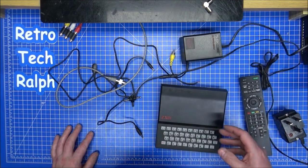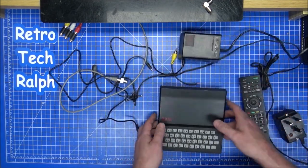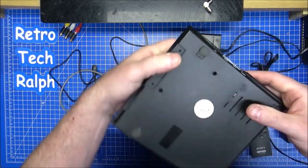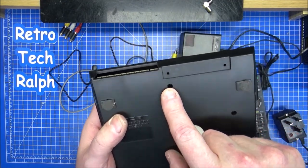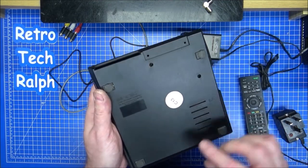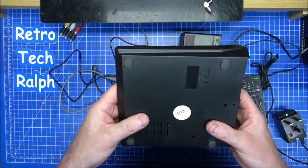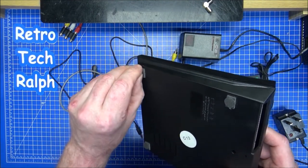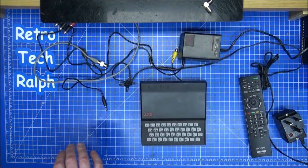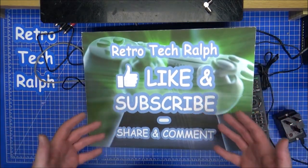Okay. So the power supply is being refurbed, and I'll look into whether or not 16 volts is okay, or if I've just blown up 1K of memory. Or whether or not there is something else wrong with this. I'm trying to look at these screws here. There's a tiny bit of silver I can see on the edge of that screw. Potentially that has been worn as well. I do hope that these feet don't need to be cut to fully come off. Otherwise, I've got to get 10 feet off anyway, haven't I? So those ones. But that's for another video. Anyway, so the power supply is potentially working, potentially going to blow this up, being 7 volts higher than what it's supposed to be. So we'll work on this another day.